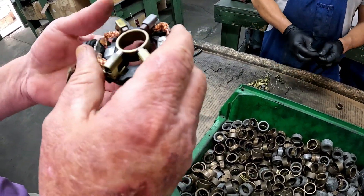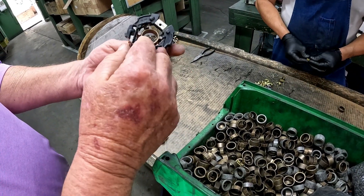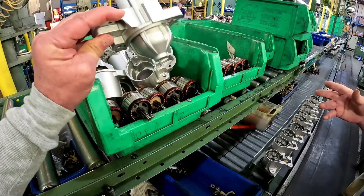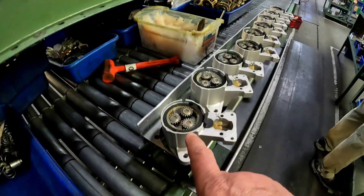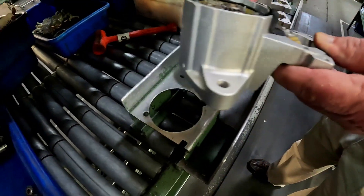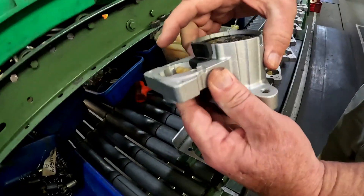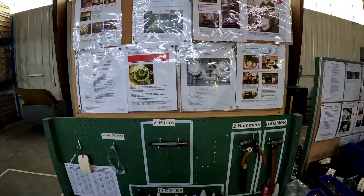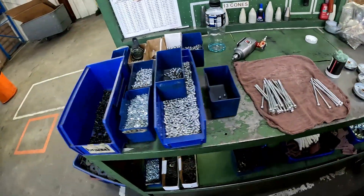This bushing here just knocks out. This loaded brush has been re-welded. That's a Mitsubishi starter nose, and these are Mitsubishi starters — that's a gear reduction or planetary gear starter. These are the working instructions here, in case you have any questions about what tools are needed and how this particular sub-assembly goes together.